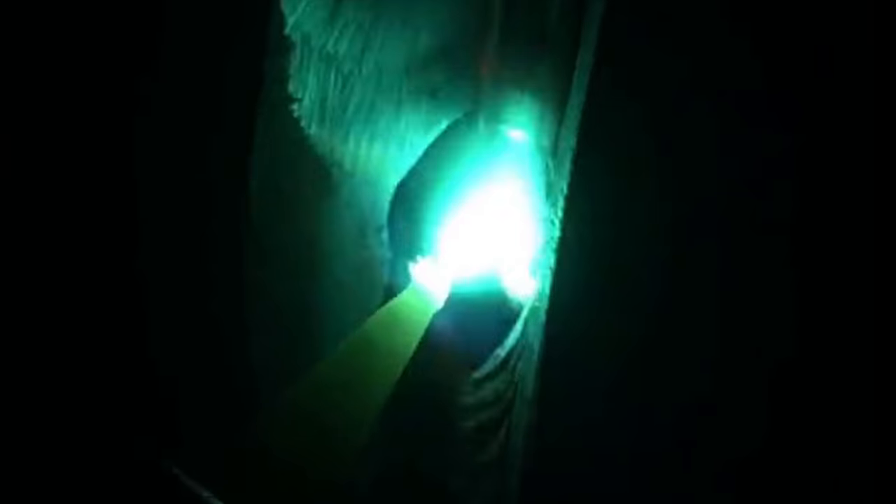At the 9 o'clock welding point, we suggest that novice friends grind the welding joint in advance into a micro-gentle slope, which makes the joint position smooth and allows a smooth transition. We preheat again, which helps the internal molding to be highly consistent.